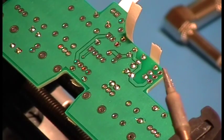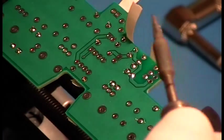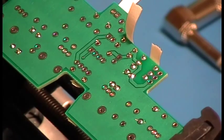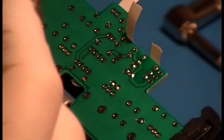Okay. It's a fast joint. It's not like 1, 1, 1, 1, 1, but it's a reasonably fast joint. 5 seconds, 6 seconds, that's a little bit too slow. You're going to risk overheating parts. You're also obviously going to risk running out of flux. There's a sweet spot in there, and I'm going to show you what the flux looks like when I'm done.